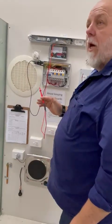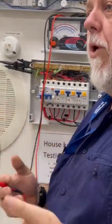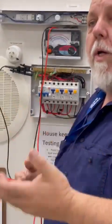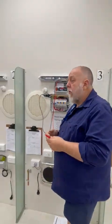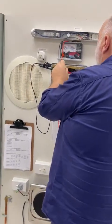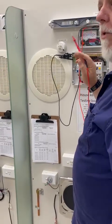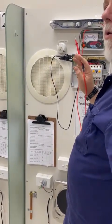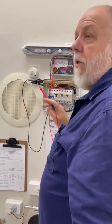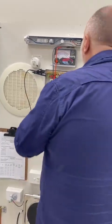Now we're going to test the whole installation. I'm going to select 500 volts — DC is twice the pressure of AC, so 230 volts AC becomes 500 volts DC for testing. I've set to 500 volts. I need to disconnect the MEN link now because we're testing the whole installation. I'll touch the probe to earth to check it reads zero — perfect. You can't calibrate on mega-ohms anyway because at 500 volts the zero adjustment doesn't function — it only works on the ohms range.